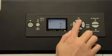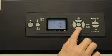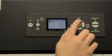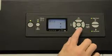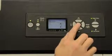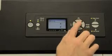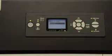Once we find the straightest value, we will go back to the control panel and enter the value for each test that we think is the straightest. Once you adjust for the first value, press the OK button to move to the second test. Adjust the value, press OK to move to the third test. If the value for this test is other than a 3, 4, or a 5, we would suggest that you rerun the test to achieve the optimum value of 4.